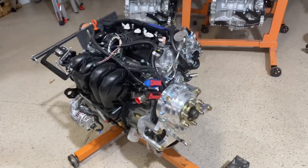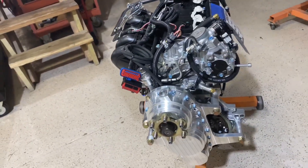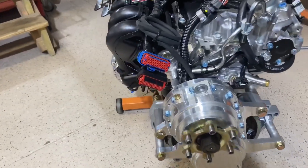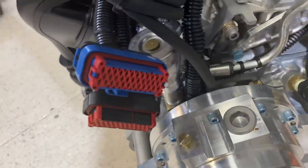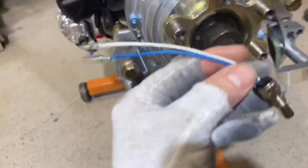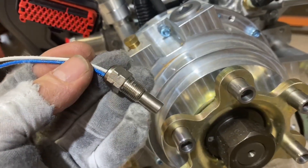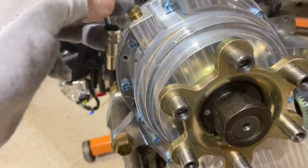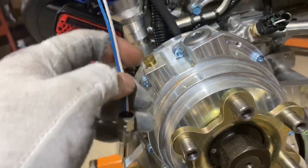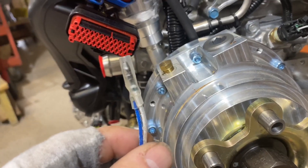Rather than watching a long video during an install of where the sensors go for your Viking View, here's a shorty. Right on top of the gearbox here is where you're going to install the gearbox temperature probe. Get it out of the box, put a little bit of Teflon sealer on there, remove the plug and screw that in, then hook up the connectors and route them to the instrument.